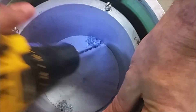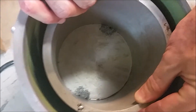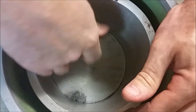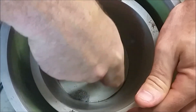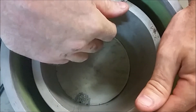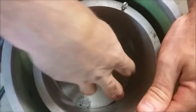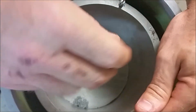So you drill two holes like that, vacuum the chips out, and that's all that's required. What that does is the centrifugal action also pulls any oil that gets past that seal down into the can — it pulls it out and opens it to vent. So when you go to pull the can out it doesn't have a big suction on it, and it doesn't allow oil to sit in there where it can wick through the casting further down into the unit.